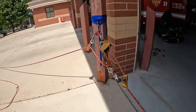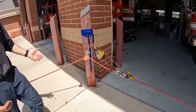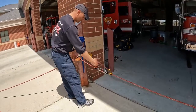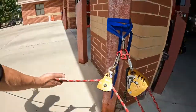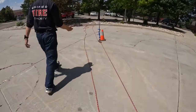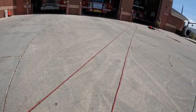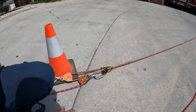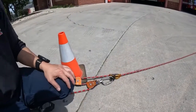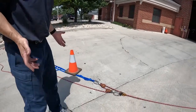We're pretty close. Fuzzy math — we did pretty well. I was within about 10 inches. This 2-blocked — and if you look at our piggyback system, our 3-to-1 back here, we got it to a point where it 2-blocked at about the same point. This 2-blocked about a foot short. So if it had 10 more inches to go, this anchor should have been 30 inches back to compensate — that mechanical advantage on the front end times that 10 inches, I need 30 more inches.